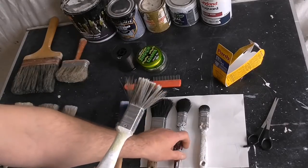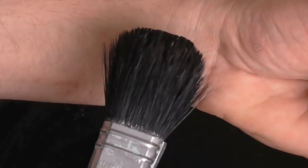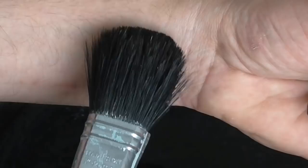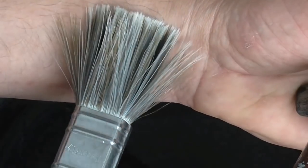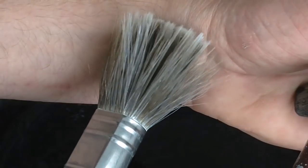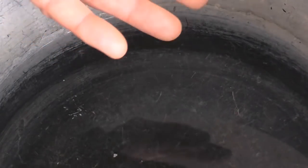Think of it like a bad hair day - or what you call a bed head. You wake up in the morning and you've got bed head, so you need to wash your hair. This inch pure bristle was a little bit rough, nicely angled from use - perfect for using on Georgian bead, painting Georgian windows. Then the synthetic is looking quite rough, so need to give it a dip. Water in a bucket - same principle as the paint - I want it to cling to the filament or bristle and draw it together.